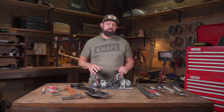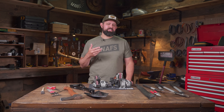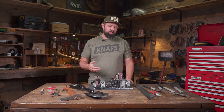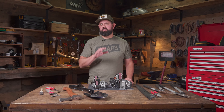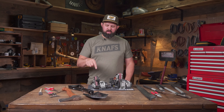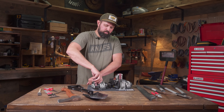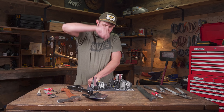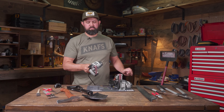Before we get started sharpening, we want to get our machine set up to sharpen a variety of tools. Most of the time when you're sharpening tools you're going to want a higher speed, so we're going to set the speed up near six or seven. We're going to have our coarse belt installed for a lot of these. On the original knife and tool sharpener we're also going to want to remove the guide — pull down firmly and pull up — and in most cases rotate that cassette forward so we can bring the grinder to the tool.